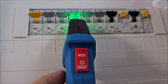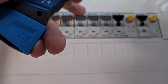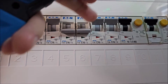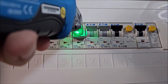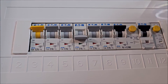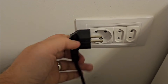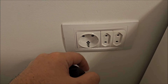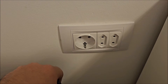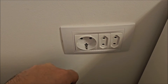For the other fuses it's just beeping slightly, but we found our fuse — number six. It seems it likes to be right there on the flip switch. Hopefully I'm not shutting off too many things because I have no clue what else is connected here. That one should now be off — and as you can see we don't get a beep, so the device should be off. Let me go and see if the device is actually off — and as expected, the device is off. I'll unplug this and write right there in the middle S6 — from Siguranță 6, fuse 6 in Romanian. Now if I ever need to shut this off I'm just looking at it: S6.